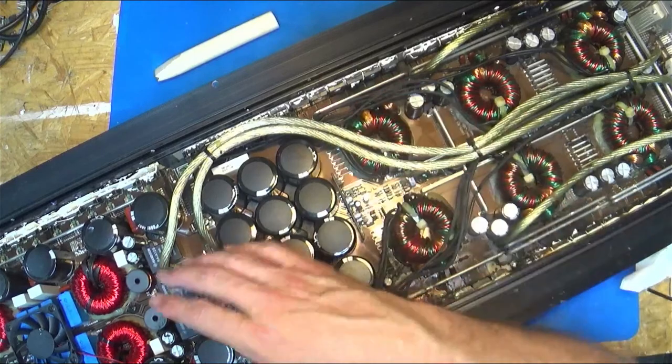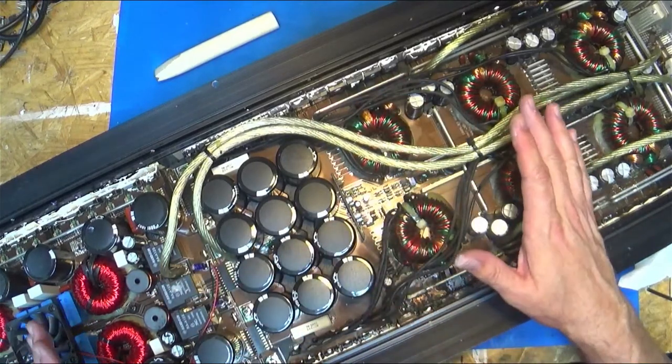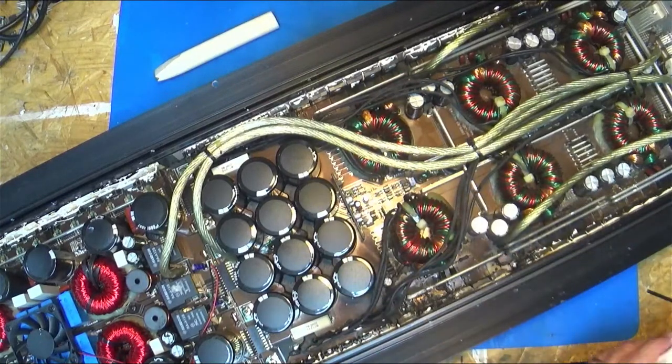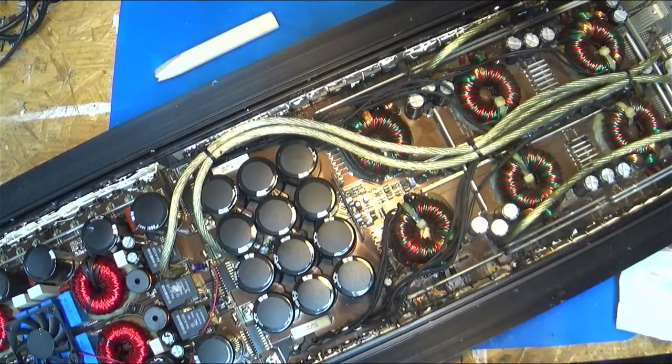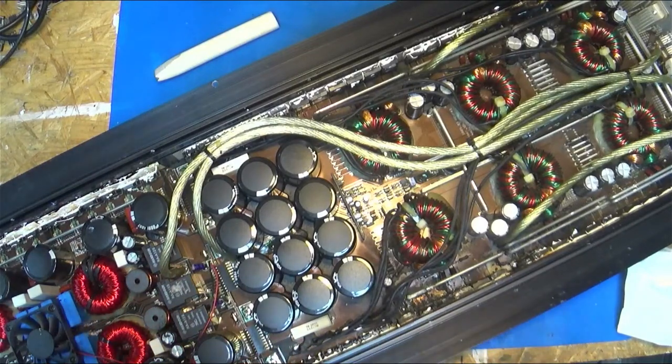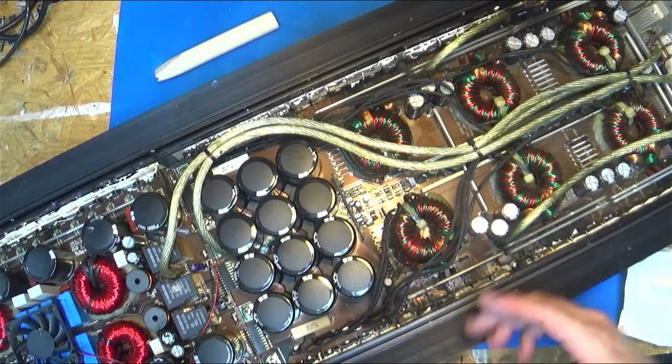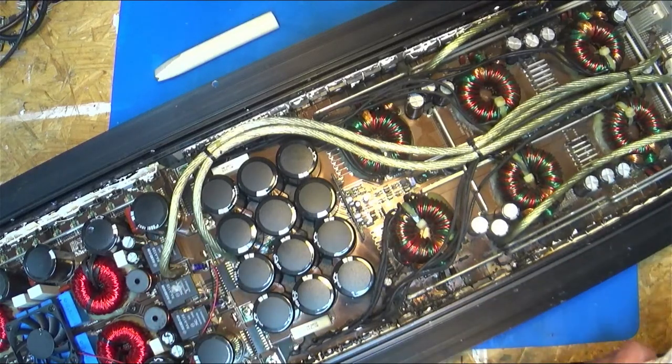And because you've center tapped it, most amplifiers, not all, will then have a positive and a negative rail, because you're rectifying half of it as positive, half of it as negative, with the center tap as a reference ground reference point, and that allows you to make your AC sine waves. Switching power supply is all this is.